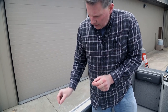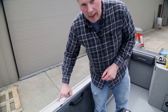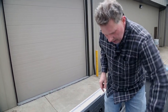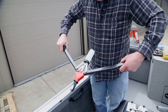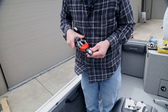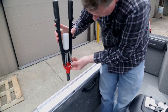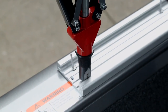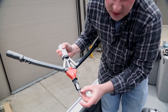A quick tip on these rivets: we've only got about three quarters of an inch of depth, and the rivet body is about an inch long. So when we drop it through the hole, it actually sticks up a little bit above my countersink — we're hitting the bottom of the inside of that box wall. There are pneumatic rivet guns out there, but this is a heavy-duty application, so we use a big double-armed rivet gun. I actually grind the side flat on my belt sander and radius the tip so that when I'm putting it down on my rivet, the head of the gun is right up nice and tight against the rivet without touching the side of my track. I want the head down inside my countersunk hole so the rivet head sits flush.